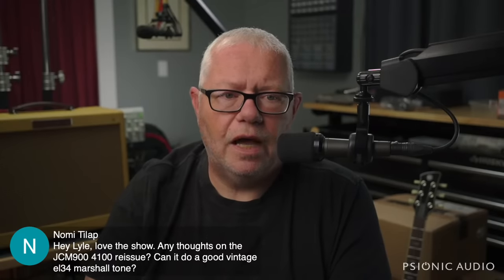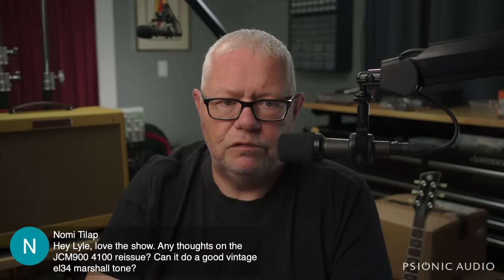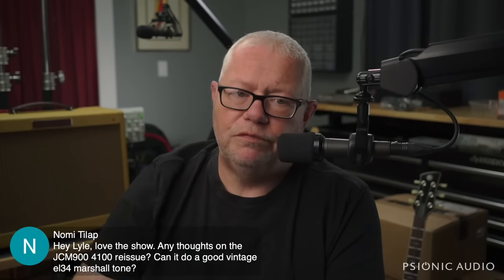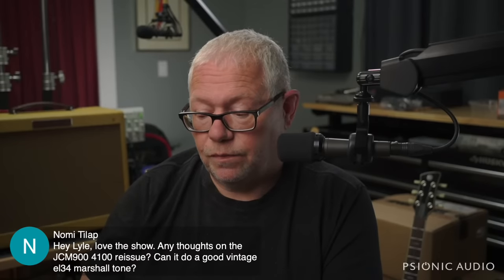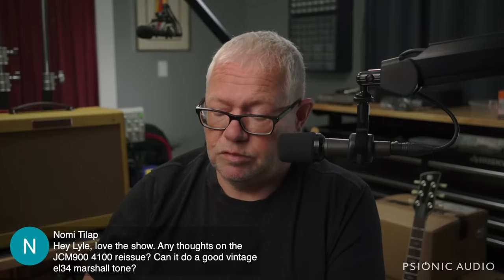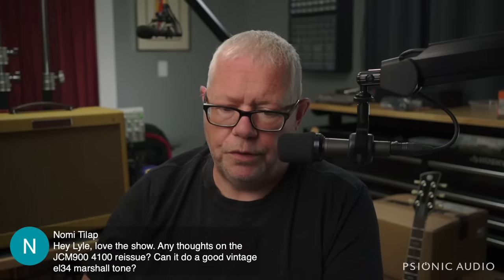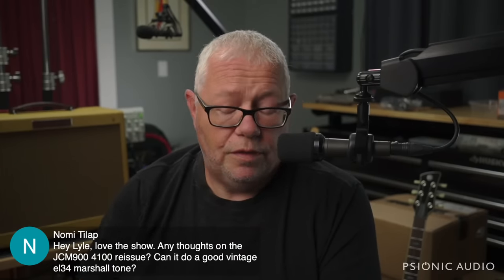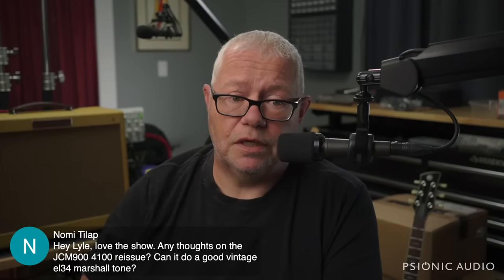Hey, Nomi Tulap. Thank you very much. I've not played the reissue 4100. I've certainly played my share of JCM 900 4100s that I've had in for service. It won't do vintage EL34 Marshall tone. Do you mean vintage 60s, 70s, or do you mean 90s? Because I'm told that the 90s is now vintage, in which case the JCM 900 does an excellent 90s vintage sound. But no, the 900 is a very different sounding amp than the 800 or any of the 60s and 70s models. It's not that one's better than the other, but they're not interchangeable. So play one, see what you think.